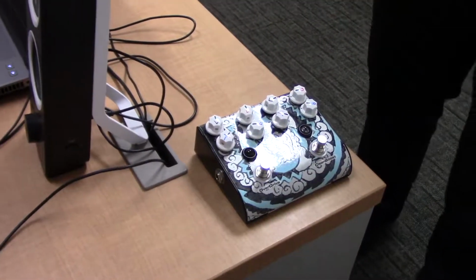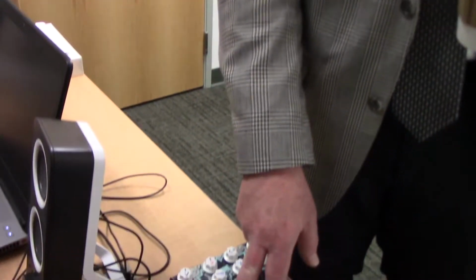So on the clean boost side, we used a JRC 4558, and I think it's a D or something like that. A new old stock chip. You can't really get them anymore. You can get generic 4558s, but this one's old school, if you will. Yeah. And on the overdrive side, we used a TL072 op amp. They're very common. Okay. Very common. They are compatible pin-out wise, so you could swap something different in there. For instance, the same pin-out on the 4558 is the same pin-out on the TL072, so those are interchangeable, and there are many more that can be used as well.